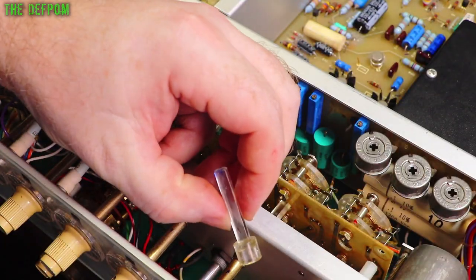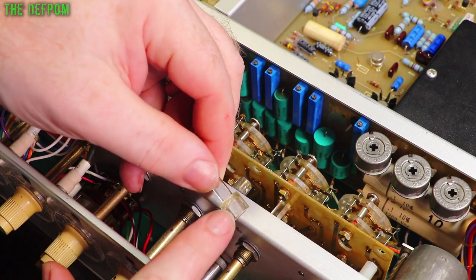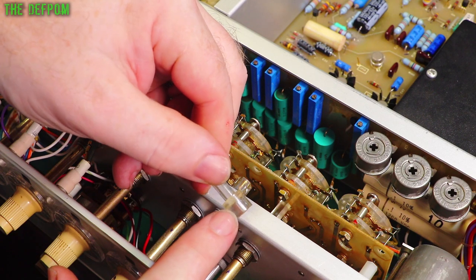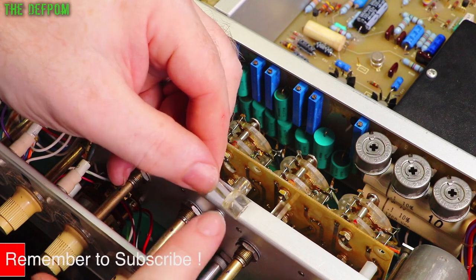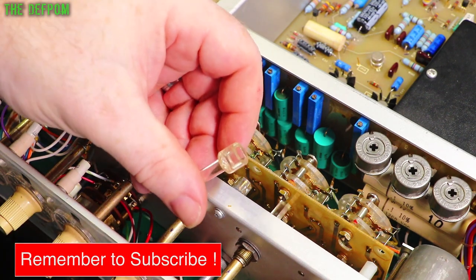Here's another one which is more like what it should look like. This one has got some defects as well — it's got some little crack marks in this end. There are actually flow marks where it's got a gate, which is where the material goes into the mould, and you've got some flow marks away from that. It looks like it's got cracks through it, so I'm taking this one out as well.